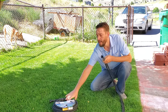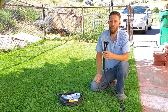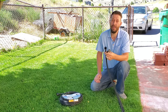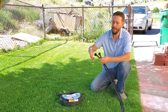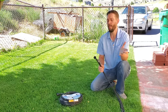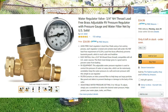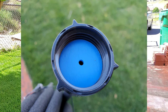If you don't have a disk, or maybe the disk fell out, got damaged, or lost, you can go out to probably a Home Depot or any home improvement or plumbing store — or certainly online — and find what's called a flow restrictor, basically a pressure reducer. It'll take the 50 psi and bring it down to, say, 25 or straight down to 10. Some of the fancy ones let you choose which psi you want. But if you've got a hose with just a little plastic disk — I'll throw a picture on so you can see it better — that does just as good.